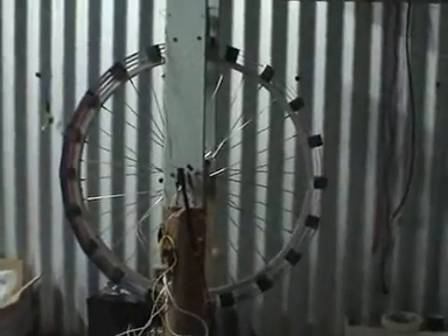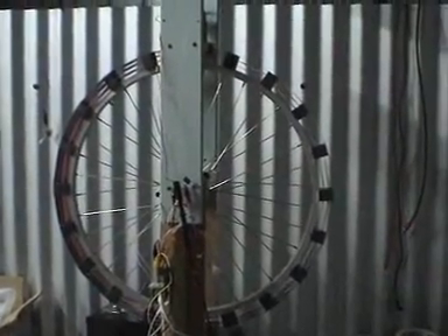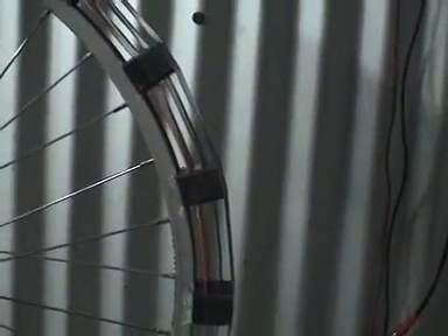We've got the rotor — it's about an 8-inch wheel with 20 magnets on it: north-south, north-south, north-south all the way around, in a triple stack. You can see the three layers of laser tape there that holds them on, along with silicon and glue so they don't become little missiles.